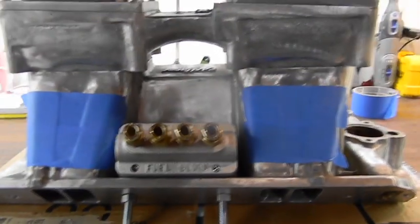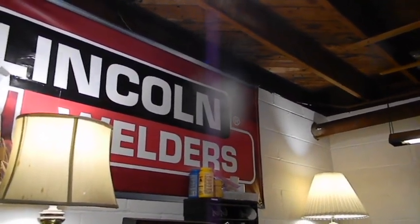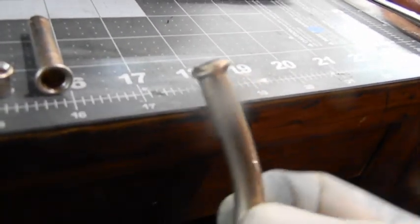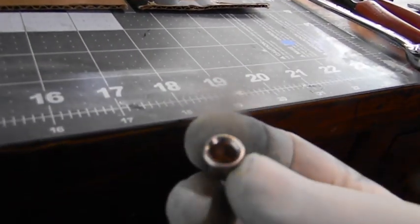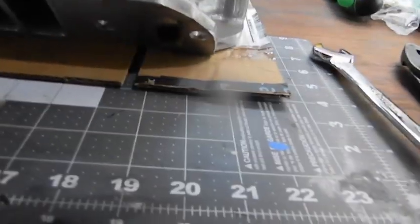Let's work on some lines. I forgot the ends again. This is kicking my butt — I still need some final tweaking but I got two done. This is the difference: first, I couldn't find my flaring tool, it's lost in the move. That's what a double flare looks like when you use a cheap home flaring tool, that's what it looks like with a decent tool from the auto parts store, and that's what a real double flare looks like when you use a real double flare tool.